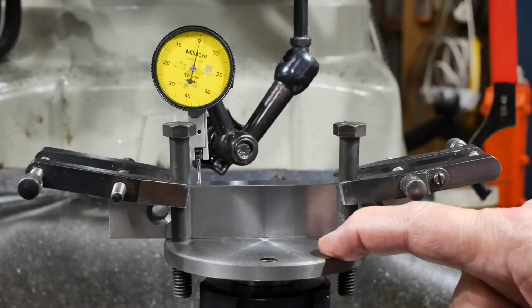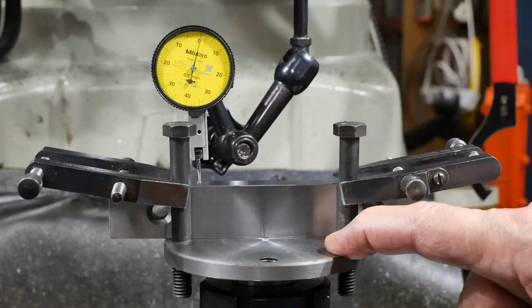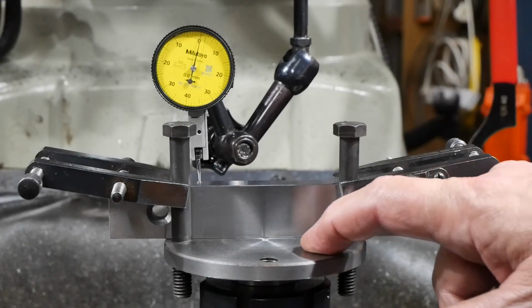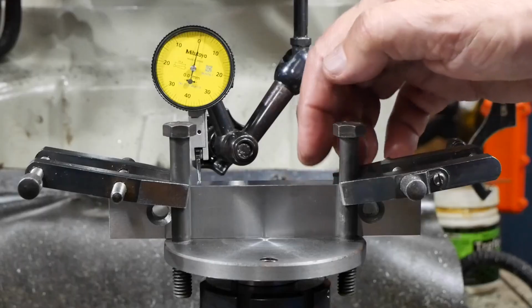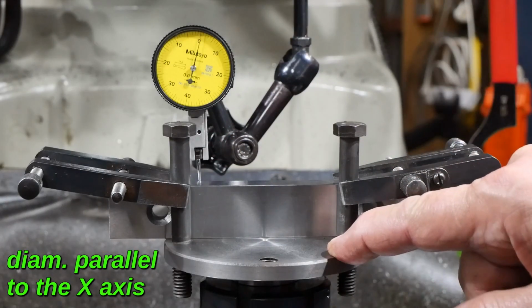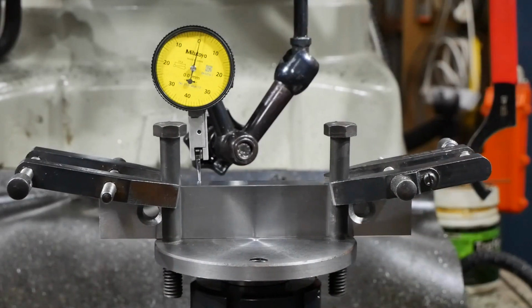I have to drill a 4-hole pattern into this plate to match the holes in the mounting for the milling machine that I'm making up, milling slide. I'd like these new holes to be centred on the existing pattern, and I think the easiest way to do that is to sweep across, establish a diameter, and then I can rotate 45 degrees and get what I want. I think I'm pretty much there.